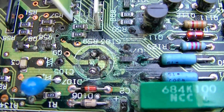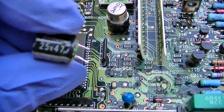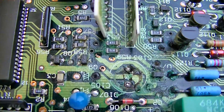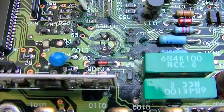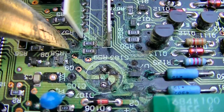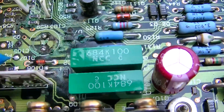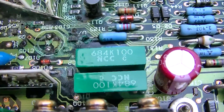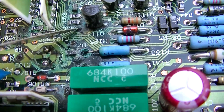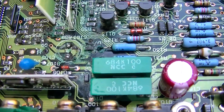I'm going to clean this up as best I can with an acid brush and brake cleaner, replace the capacitor, and inspect all the traces hoping none are bad. Things like where the trace goes through the board can completely ruin these — you can spend hours verifying all the traces trying to find the open one. These eyelets that go through the circuit board are the damage concern. It would be so much better to just prevent this and recap these computers.